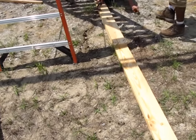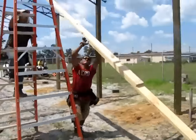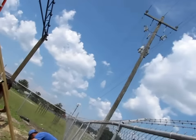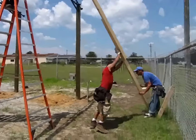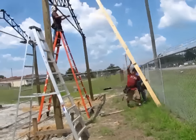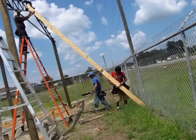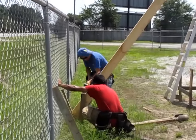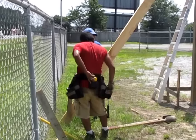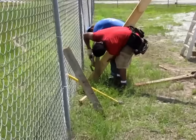This is the truss brace. Scab two pieces of lumber together as shown, then drive a stake in the ground and fasten the brace to the stake. Next, when the truss is plumbed, fasten the brace to the bottom of the truss. On wider buildings you should use two to three braces like this. This brace will stay up until the building is complete.